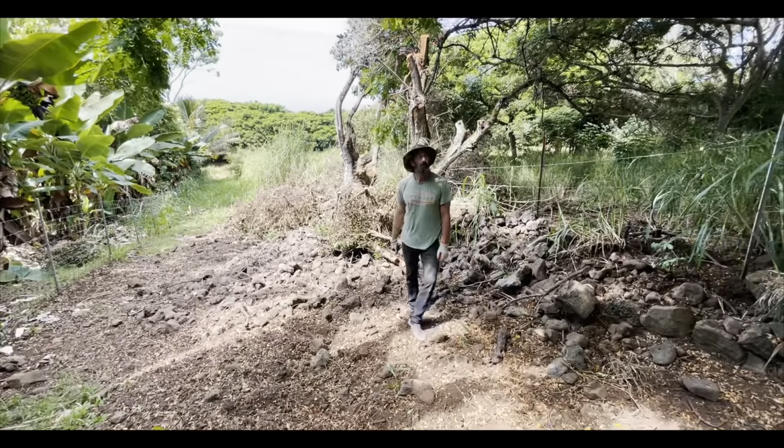And you can see these are starting to lean flat and almost out in some places, in which case I need to take these out and reset them and start the wall from the bottom up, okay? These are dry stack. There's no glue in any of these walls. It's just rock stacked and fitted, locked in with smaller rocks.